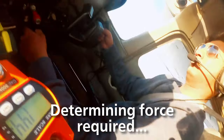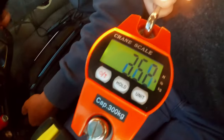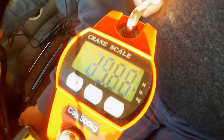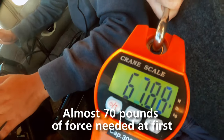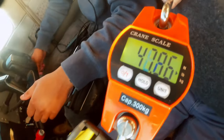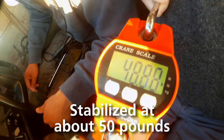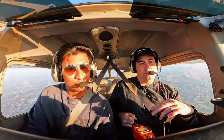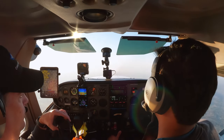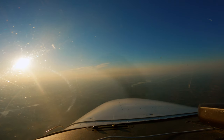You're going to gently release your grip on the yoke, and I'm going to hold it with our force measurement tool here to see what we get. All right, I'm starting to pull. All right, I'm off the yoke. And I'm holding force — I don't know if you can take a look at that reading there. It's over 50 pounds at times. That's a lot of force. And you'll see, as I start to release, we would be going down in a hurry.